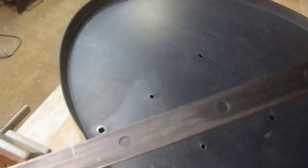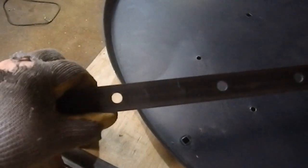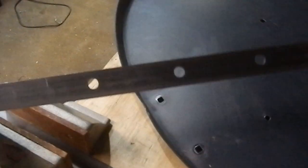And because this is so soft, I was able to drill these out with a 3/8 inch drill bit from the get-go. I just made sure it was lubricated and zoom, zoom, zoom right on through. As opposed to using a higher quality 1/4 inch drill bit, which I own a number of, then opening that hole up. This also gives me a nice clean hole. You get a really nice finish in there. This just comes out really beautifully drilled in this mild steel. It's very pretty. That just makes me smile.